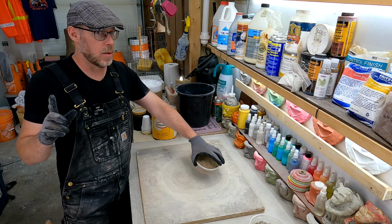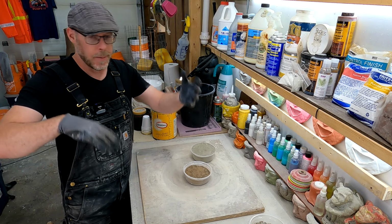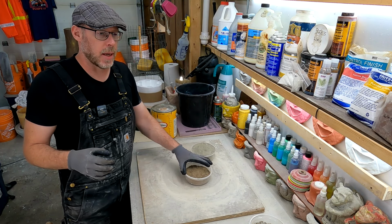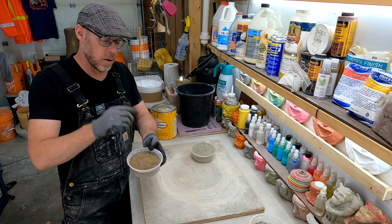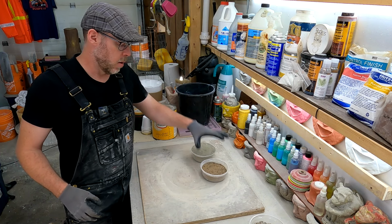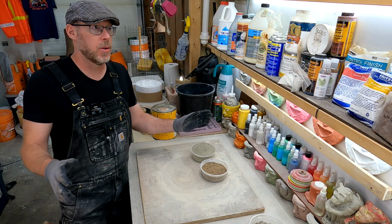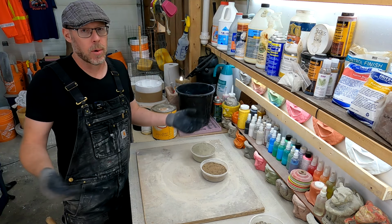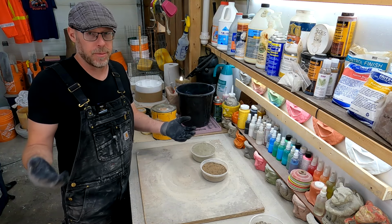And the sand needs to be not play sand, which is tumbled and rounded and doesn't have the random edges that a rough sand, or a sharp sand, would have. And that's what this product is: sharp masonry sand, free of stones, sticks, bottle caps, etc. One cement, one sand, and is that it? Not even close. If you just did that, you just made mortar, it's not going to really do what you want. You'll feather edge it, but it will fail over time.